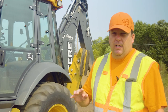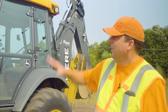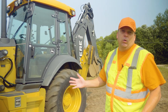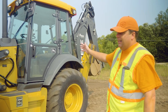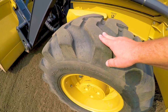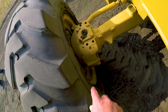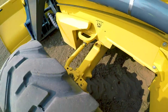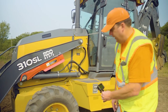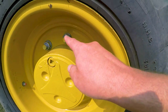For my general walk around, starting wherever you start, I try to be consistent — usually at the driver's door. I'm going top to bottom, left to right, looking for anything obvious. Starting up front with the backhoe loader, I'm looking at the tires — checking tread wear and any damage. Then looking at the planetaries, the drive systems on the inside, making sure there's nothing loose, nothing leaking, and checking overall inflation. And making sure all your lug nuts are secured.